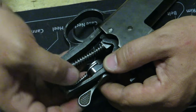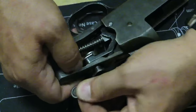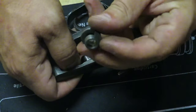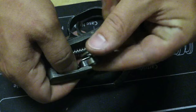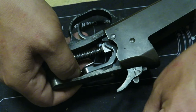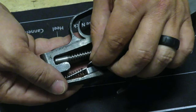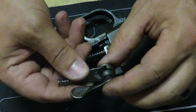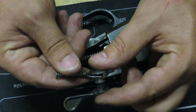This whole thing will slide up and out, but remember this is under spring tension. Take your fingers, hold this spring down, and work this up and out. Now remember this little cup piece goes towards the rear — that's how it sits down inside there. You can pull this spring up and out like so. Remember this guy fits around that screw like that — that's how that goes in.